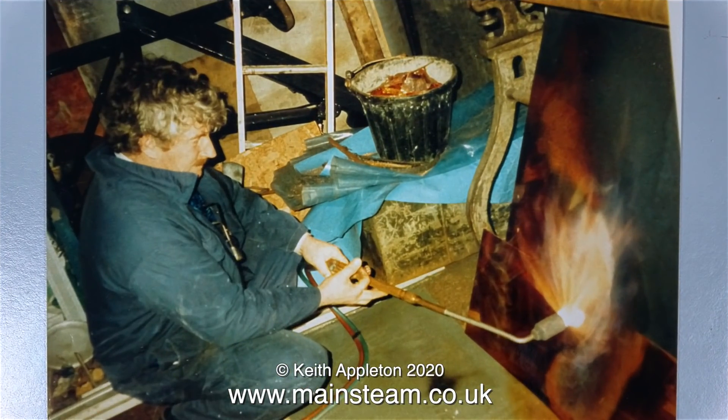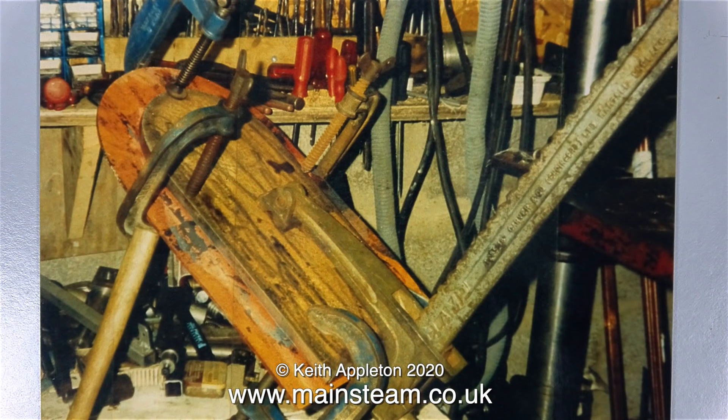In this picture, with the help of a very powerful gas blowtorch, I do believe that the copper sheet is being annealed, and it must have got pretty hot in the workshop that day. This clip shows the copper mounted onto a former, ready for the shaping of the plates — well, at least one of them.